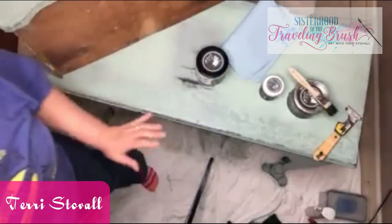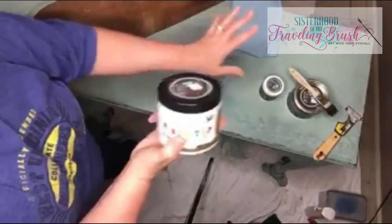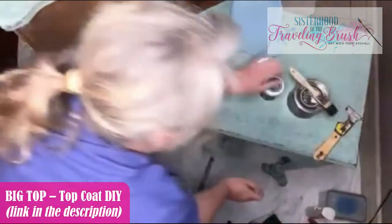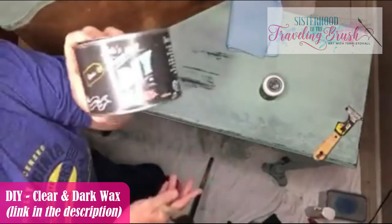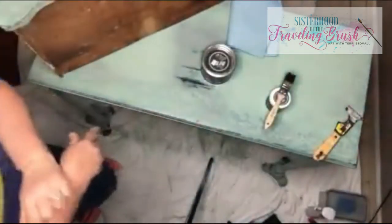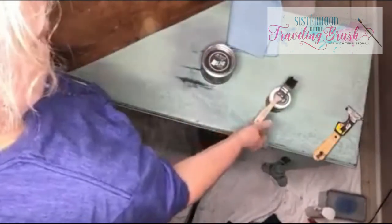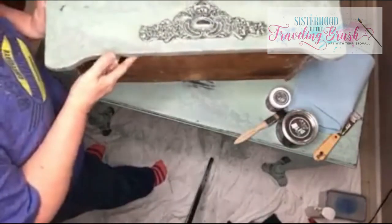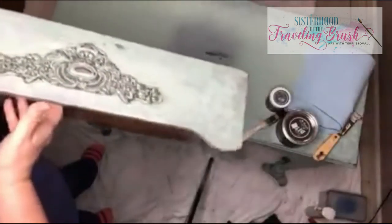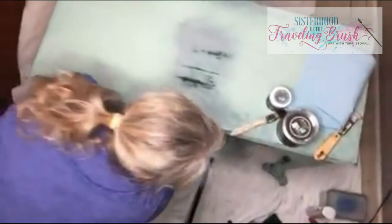I'm gonna show you what I got going on here. I got out about four shop towels, and I have put two coats of Big Top on here as a top coat, and I got out clear wax and some dark wax. Instead of making my own wax, I decided to just go with the dark wax because it does match pretty well with this, and it's gonna look good. This piece is done, and we're about to do the top. I think this turned out great — see how much darker it is? A little bit more aged looking than the top.